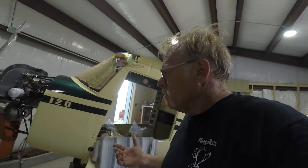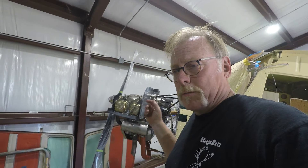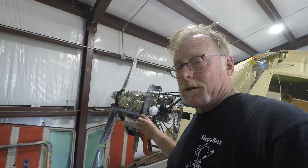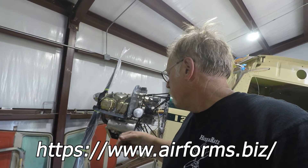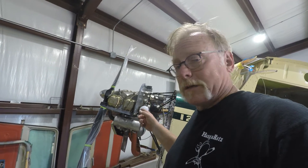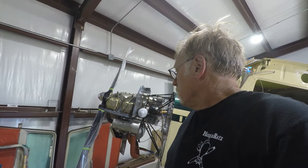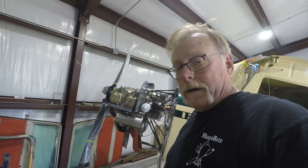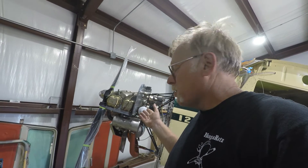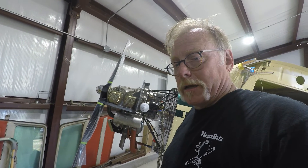That's it for this episode of Hangar Rats. If you've got crapped out baffles, two thumbs up to Airforms up in Wasilla, Alaska. I believe they're being sourced through a couple different places — possibly Spruce, Air Performance, and possibly McFarland also. I'm going to put the contact info for them in the description below. I can assure you this is good stuff, I am very impressed — this is the best looking stuff out there and they even powder coat it if you want to. Total touch time: we started with an engine with no baffles on it so we didn't have to take any nasty crap off — I'm going to say three hours. If you had to take all the baffles off, clean the engine and all that, probably four hours total touch time re-baffling your engine. This is for a little four-cylinder, an O200 in a Cessna 120. It's an STC installation but you still use the old baffles.